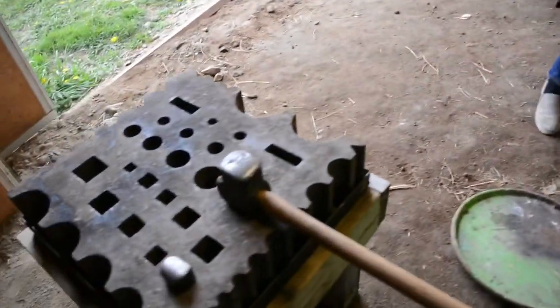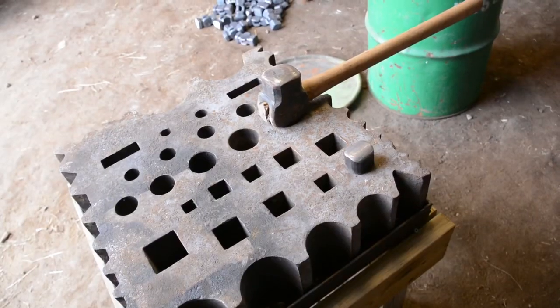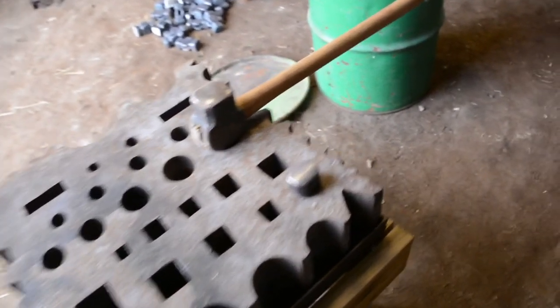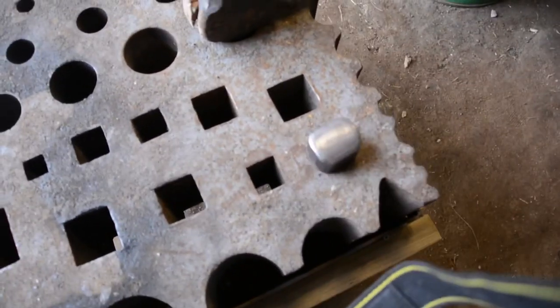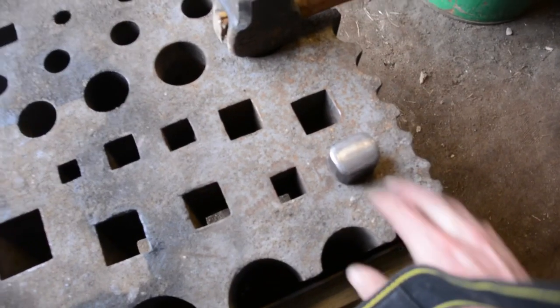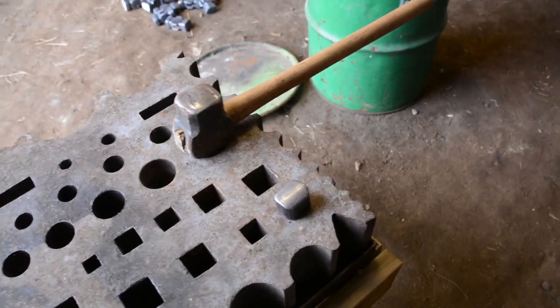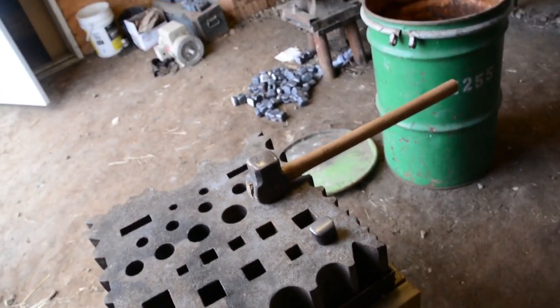And so we're using the new swage block probably. And over one of the holes we'll have the hump tools, and we'll just insert the drift as to not collapse the eye. And then we'll use the big fuller in this 1-inch hole, and we will use that as kind of our anvil on the underside when we put the touch mark in. So hopefully this works well, and I'll give you lots of updates, obviously.